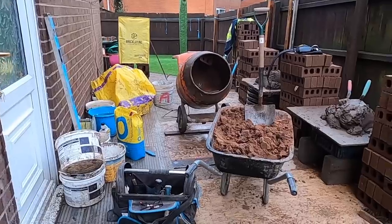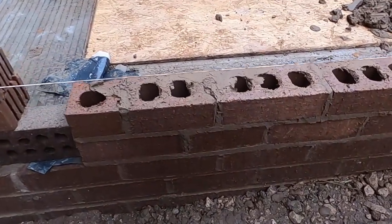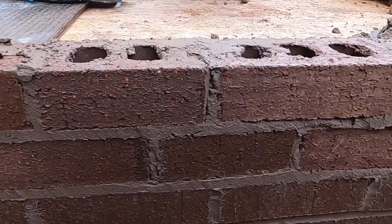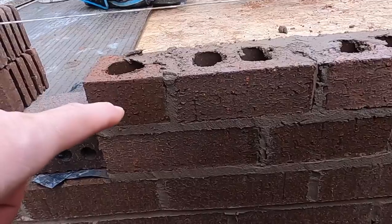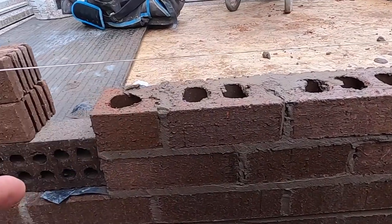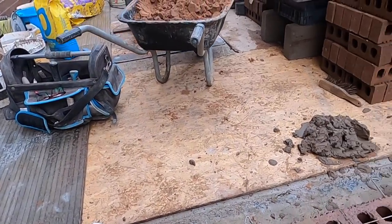Right, we're up and running. Now it's all set out. 3/4 in it. There you go, 3/4 in it. And what I always do is put the full brick, then the 3/4. Obviously your half and your 3/4. And then your 3/4 isn't as obvious in your brickwork. You won't see it going up the door jamb then. It's set back. It's a bit tidy.